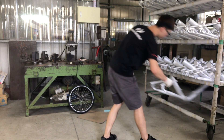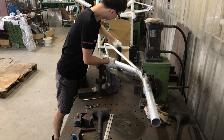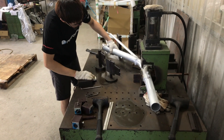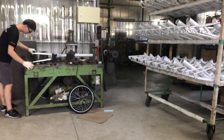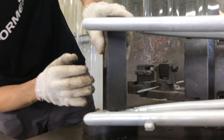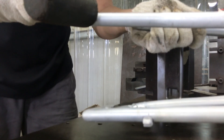Now to straighten each frame in this batch. The heat from welding slightly warps the frame. We measure the crucial angles with a number of jigs and make corrections with the hydraulic press and a hammer.